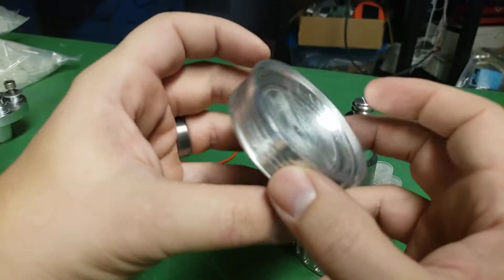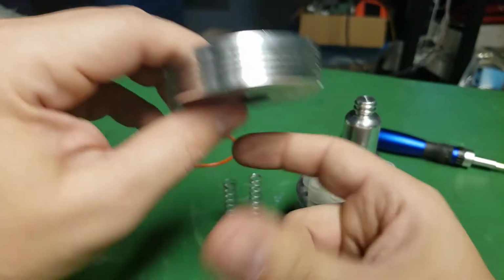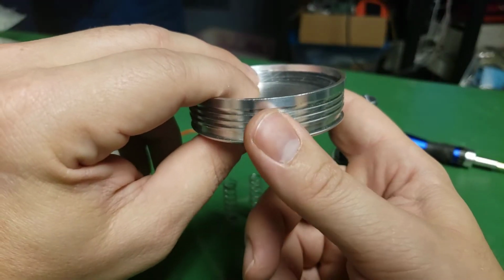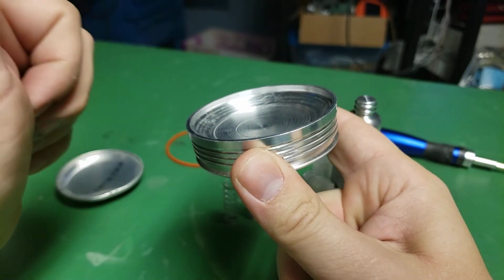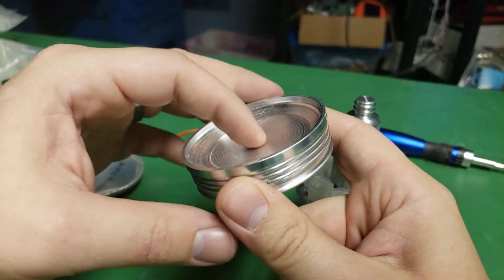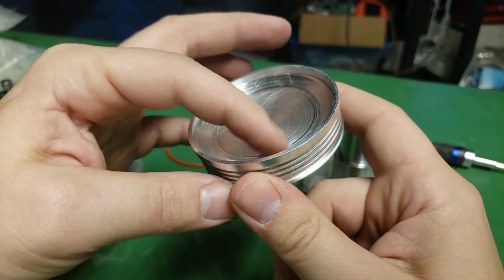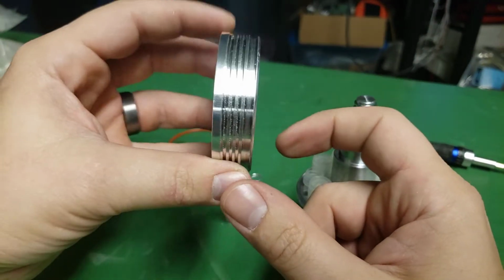And then I flipped it over, and I had a pair of soft jaws, which is just aluminum vice jaws that have had this shape cut into them. So then I could hold it on this, and then I machined the back, cut it off, and then used a ball end mill to do an interpolated feature there. A little bit slow. This would probably be better on a lathe part, but I'm more comfortable in the CNC mill right now, so that was the easier way to do that.